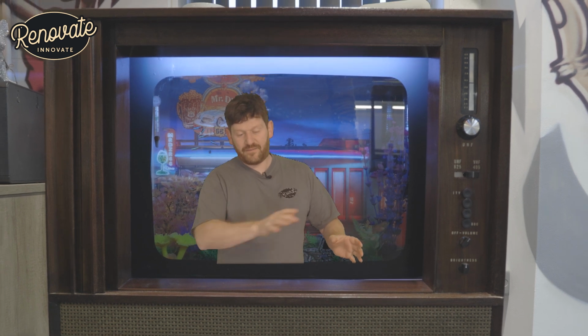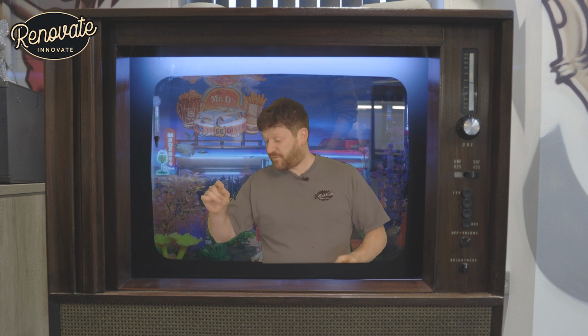First thing was, we gave it a French polish, and then we gave it a burnishing cream over the top to make it really shiny. There was a few bits of veneer we had to repair, they were tricky. We used waxes to fill some of the cracks and the holes that were in it. The tambour door, we didn't want that to close the fish tank, so we just held that back.